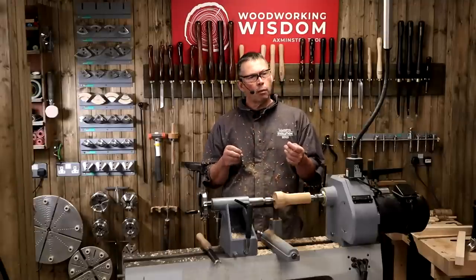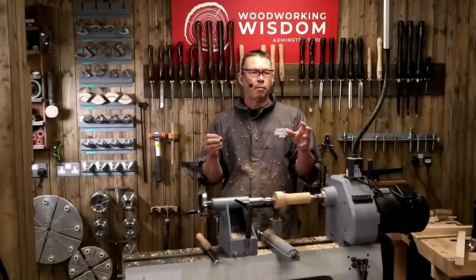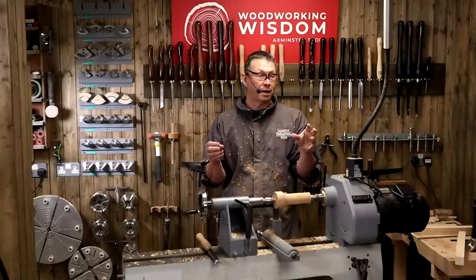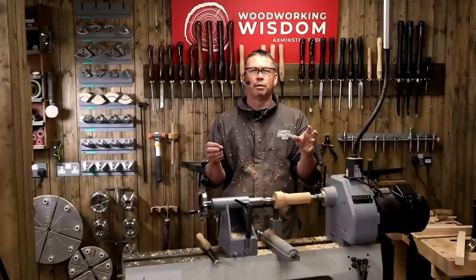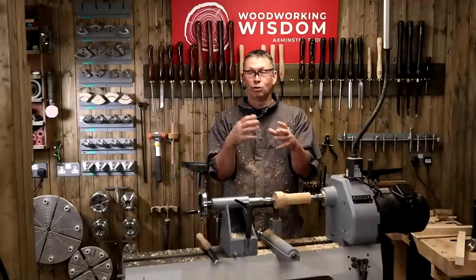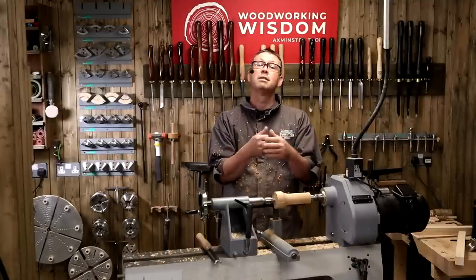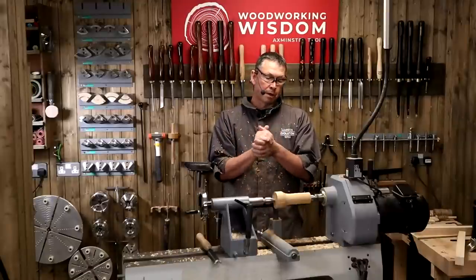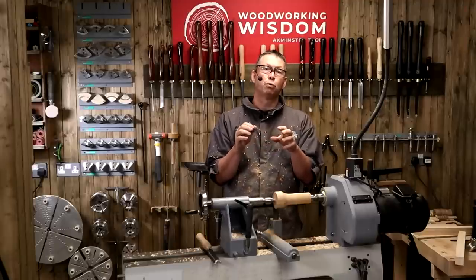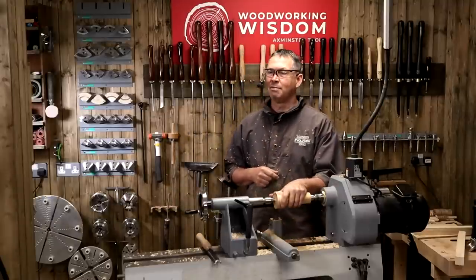Cuts beautifully. One of those grains, it's not a particularly open porous grain at all. It holds an edge well. It used to be used traditionally in skittle balls, if you know what the game of skittle balls is, in the southwest of the UK here. We have a game called skittles, which is a little bit like tenpin bowling, but done in pubs with lots of beer. And so the skittle ball, which was usually between 5 and 6 inches in diameter, was made from apple because it was quite hard, with sycamore pins or another fruitwood pin. But yeah, so it's fantastic to turn. Just be careful if you're storing it to dry for too long. It is prone to woodworm, so just keep checking it. But yeah, you're going to have a nice load of timber there, I would imagine.